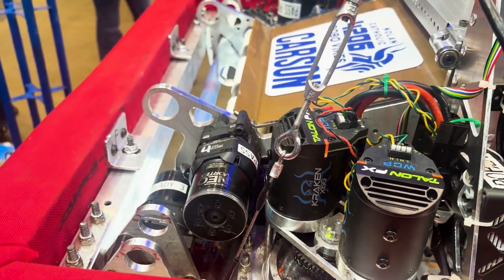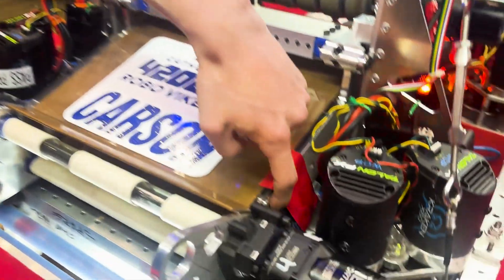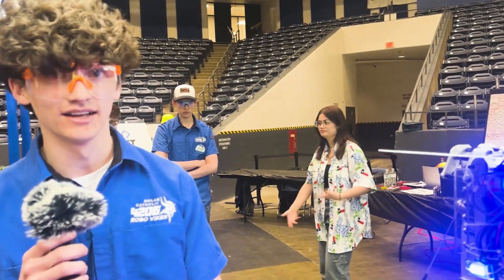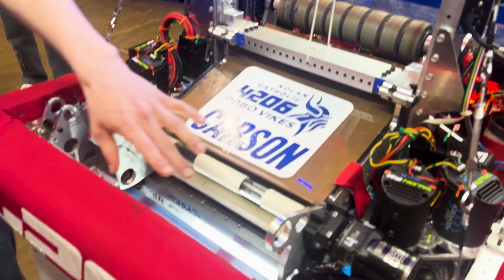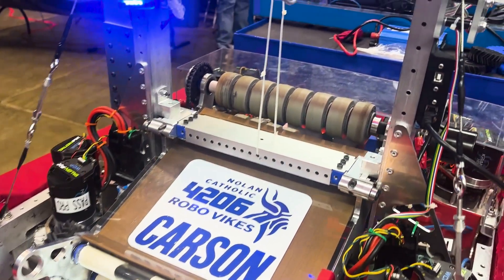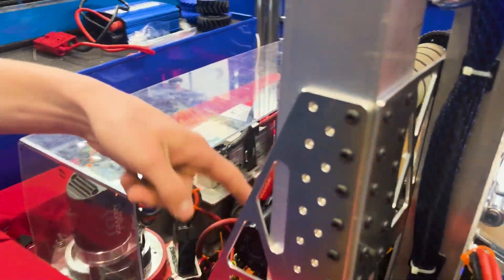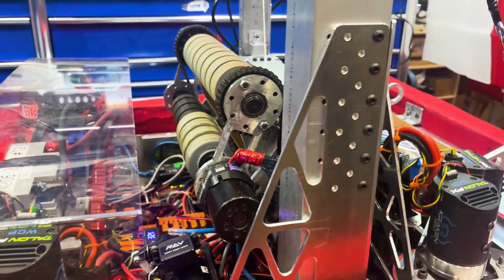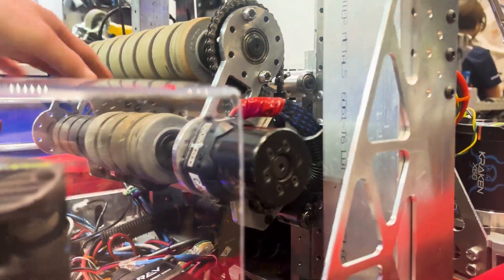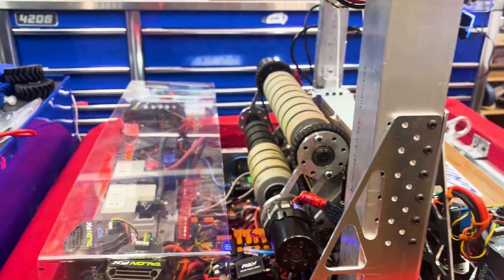The intake and conveyor Vortex motors are both running duty cycle on a range of negative one to one of motor output. This beam break sensor is what helps our robot sense where the note is — once the beam break senses an activation, the conveyor runs at a slow speed for about half a second and then the note stops right in position every single time. Both shooter motors, top and bottom, use PID control using the built-in Vortex adjustment. The pivot on the bottom, which allows the shooter to rotate, is also controlled by PID and relies on the interpolation lookup table that runs off the limelight.